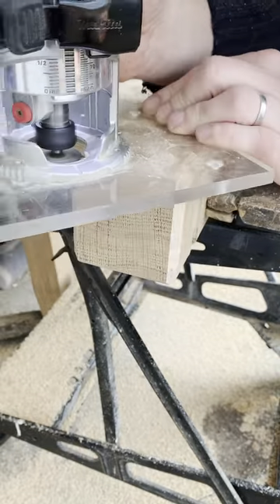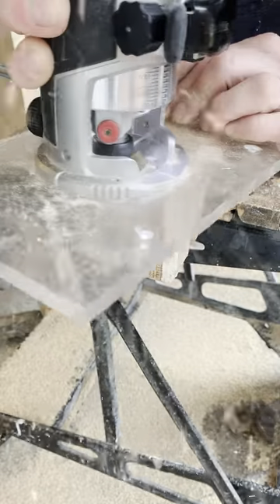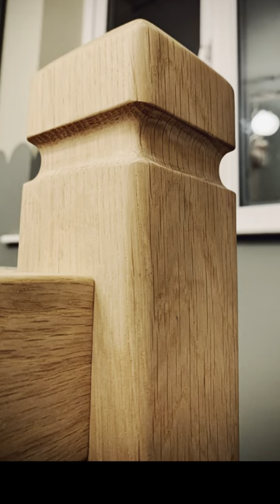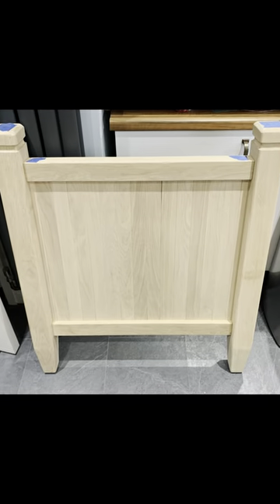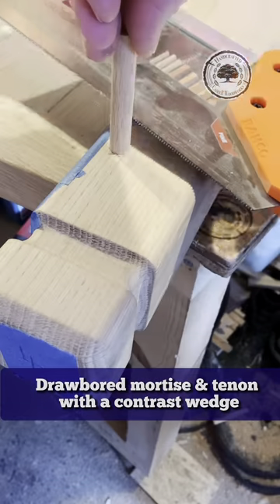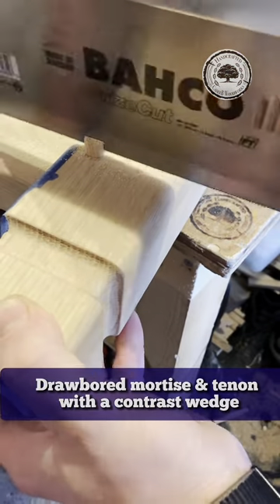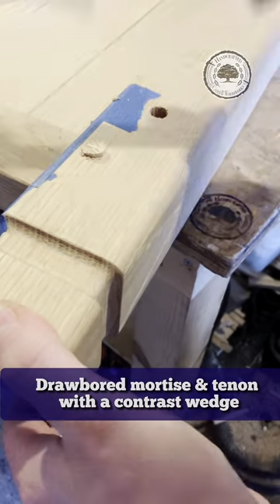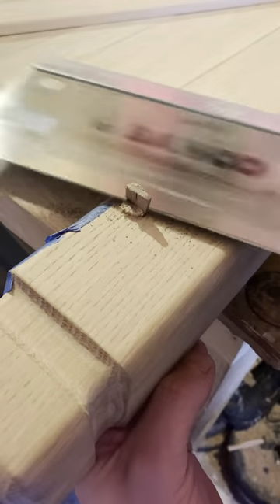The end panel is complete — fitted to the framework, all the shaping done, and I did quite a bit of sanding to get it all ready. All dry-fitted together and marked up, the final stage for the cut ends was gluing up the joints. For this I used an offset tenon to the mortise, popped a draw pin in, and then hammered it home. There's a lot of tension in these, but fairly hefty draw pins, so they've pulled the joint nice and tight. It's all finished off with a contrasting walnut wedge just for aesthetics, and it turned out really nice and clean.